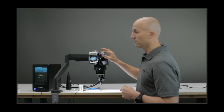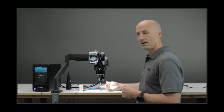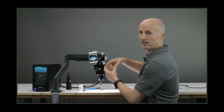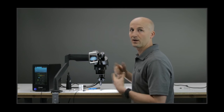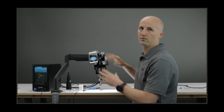You also want to be able to focus your scope. Once you can see where your electrode is under the scope, you want to have that electrode right in the center of your circle view. Today we have a camera view so you can get an idea of what I'm seeing when I look through the microscope. We'll show a couple welds on that and then remove it so I can use both eyes and get a good retipping prong weld.